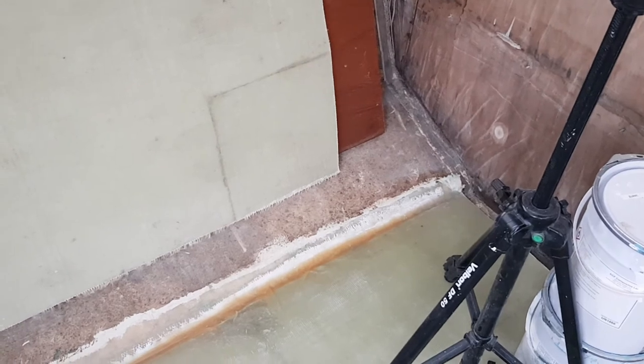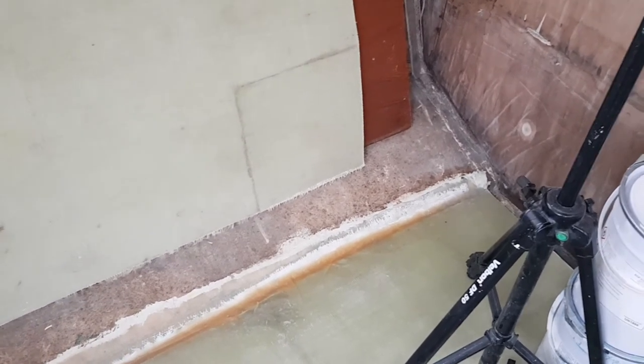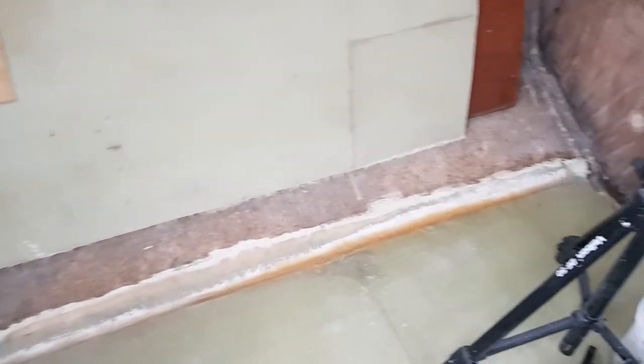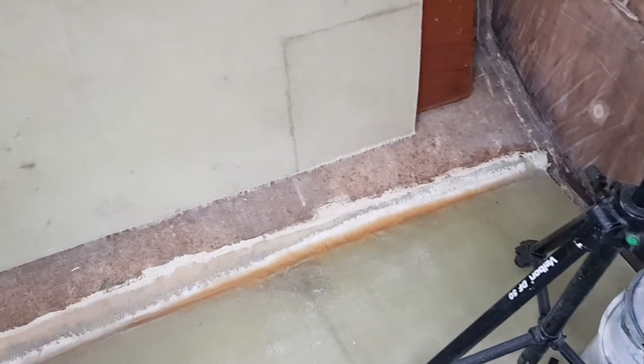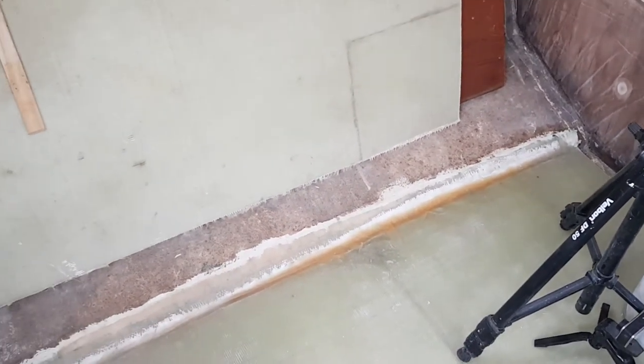So that's both sides nicely resined and battered. Delicious. So now I'm going to take some of our slightly older biaxial cloth and tab it in. I think two layers of tabbing per side. So we do need to make up for some lost material on the shoulders. But this should really put us in a fantastic position.